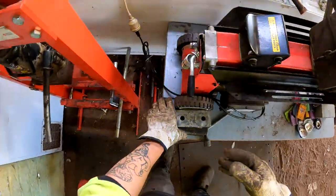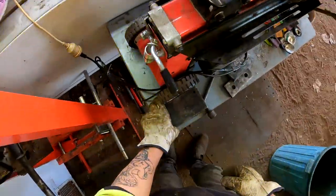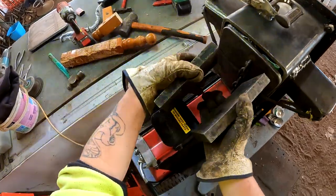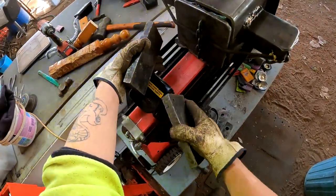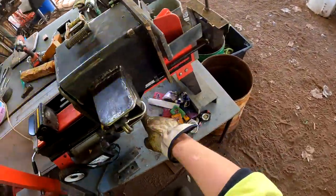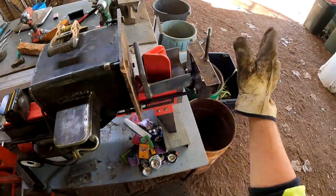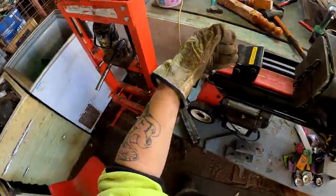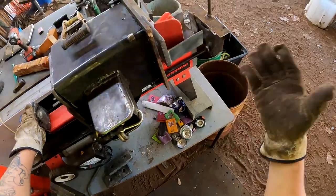Now I have thought about making up a headstock where there's 2 plates like what I'm going to be holding here. These are pretty heavy, but so that they actually just bolt in like that. I could probably make something up so it bolts in there anyway, but that is only held on by a couple of rods that are going through underneath here, and that's all they are. A couple of pieces of steel rod with a bit of thread on them, and the ram's up here and it's pulling that way. It's not up here pushing it. It'd be a very short ram if it was. So that's how they've made this block splitter, the log splitter, whichever you like to call it.